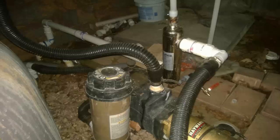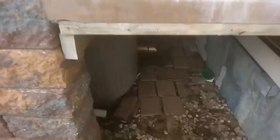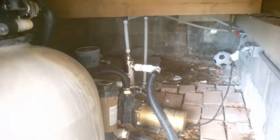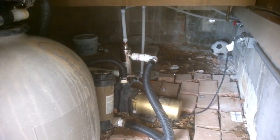Be sure to use the largest diameter PEX possible. In this case we had three-quarter-inch threads on the top and bottom of our heat exchanger, and we used three-quarter-inch PEX. For this particular application, you can see that the PEX was used to bring the hot water out to the heat exchanger.